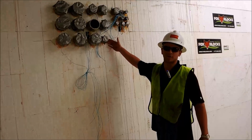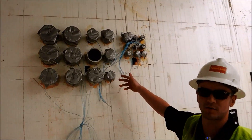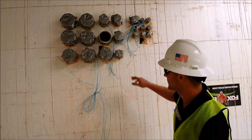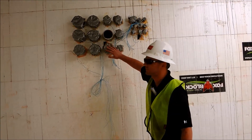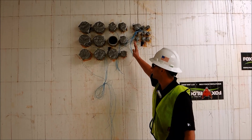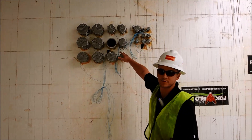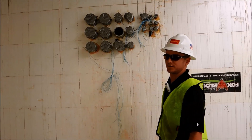These 12 inch block are awesome. You have multiple wall penetrations, which is easily done with just a core drill and then inserted directly through with PVC or some kind of plastic piping. The wall is poured with these in it and then you come back afterwards and make your attachment to it — easily done.